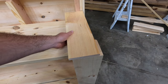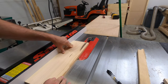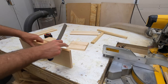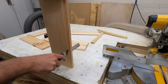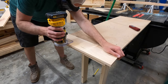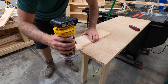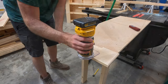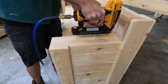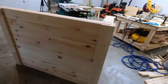We're back to that one piece where the panel had to be trimmed to fit, and this part got a little bit tricky because this sidewall is shorter than the main wall. How I connected the main frame pieces together left me with a weird overhang that was kind of awkward to work with. I trimmed a slide on this piece and it'll go on top of the 2x4 I put over the shelf earlier. I'm cleaning it up with the chamfer bit. Those vertical pieces around the corners are also trimmed with a chamfer bit on the inside where they don't butt up against the other piece. Here's a look at how everything is coming along — we almost have every piece on here.